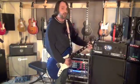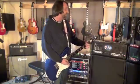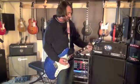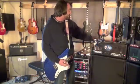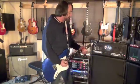What we're going to do is play an open chord. Just blast it out and while you play that open chord, you're going to cut both the power and the standby. You're going to hear that last bit of life fizzle out of the amp — that's the caps discharging and that's what you want. We'll do it with a couple RM100s. This one is a regular RM100, this is the Lynchbox, and this is the RM50. We'll do it with each of them.